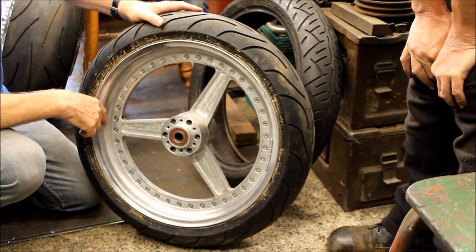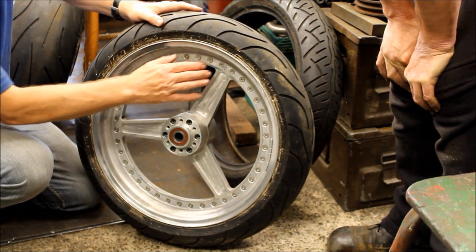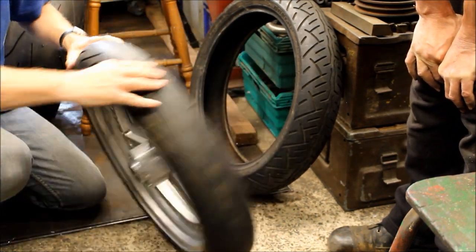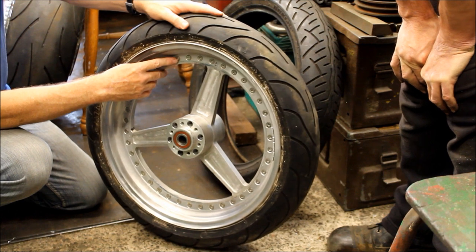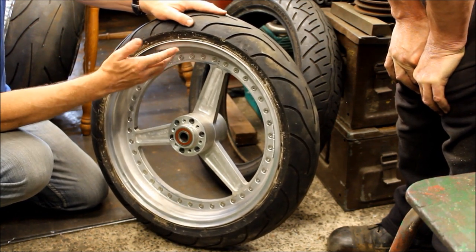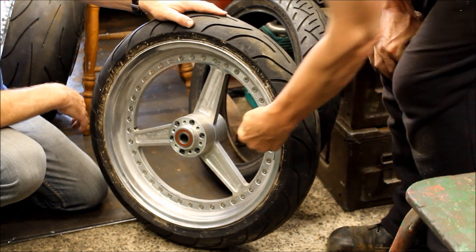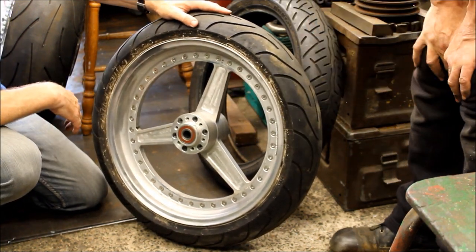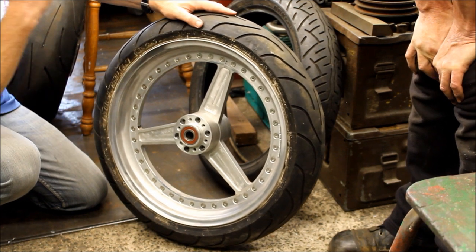What's also clever is, I don't know if you noticed this, but there are no nuts visible here and no nuts visible on that side. And that's because all these holes are blind holes that have been threaded by Jeff, which must have taken hours and hours and hours to keep it looking nice and neat and tidy. The screw heads from the other side are in between the two of them, so you've actually threaded the billet centre. Yeah, a lot of work that.